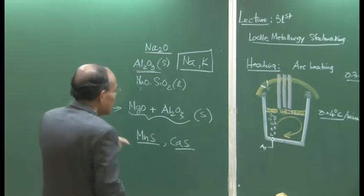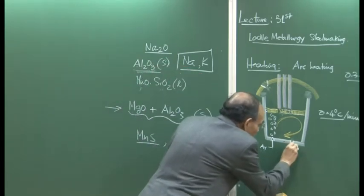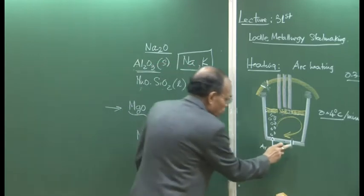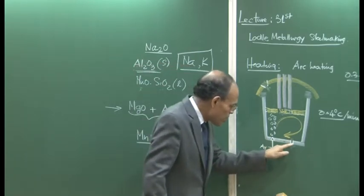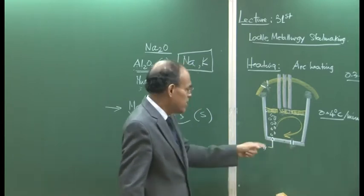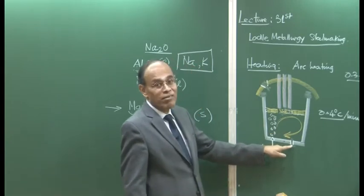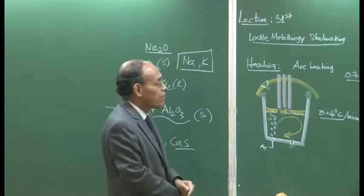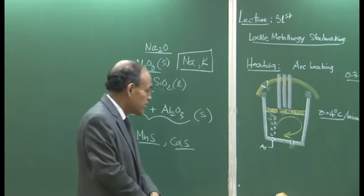But this wall adhesion itself, when we will be draining, if you remember that we have a little drain here, or a well block through which molten metal is going to be drained, it is when the inclusions pass through this that there may be deposition of inclusions. This is not so prominent in ladles, because from the ladle the flow rate is relatively high. That will be clear when I draw a ladle, tundish, mold setup in the next class and explain to you what happens beyond the ladle metallurgy in steel making.